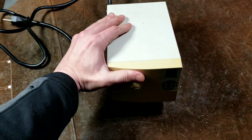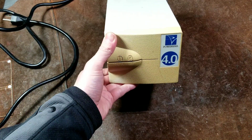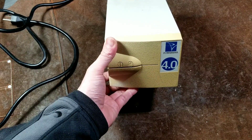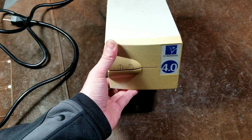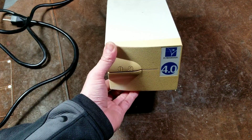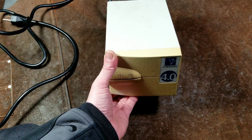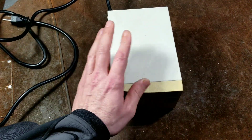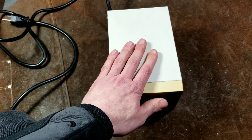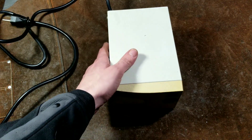These are the next stage of power conditioning equipment. I did a review just previous to this video of a voltage regulator, which helps with wide swings of power line voltage. It has noise filtering that's pretty high quality, but it is still more like a high-quality surge suppressor, like an isobar. These isolation transformers are what I consider like a level 3, and arguably level 2 in many situations.